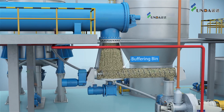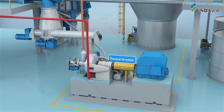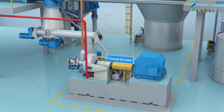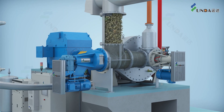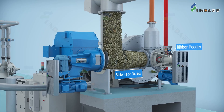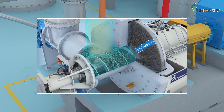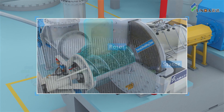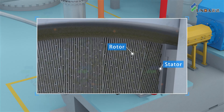The softened chips are fed into a thermal shredder via a feeding device. The thermal shredder is a core equipment for IPCTMP technology, for which YUNDA has a number of innovation and improvement patents. The softened chips are first fed into a ribbon feeder through a side feeding screw and then pushed into the thermal shredder, where the chips are shredded and kneaded into uniform hair-like shreds by and between rotary and stationary disks.